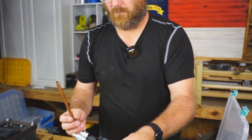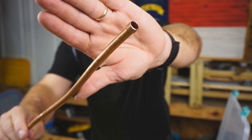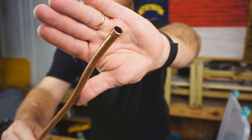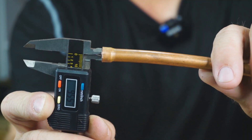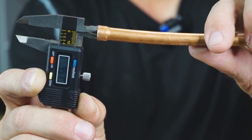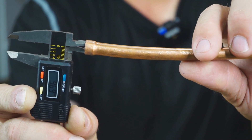That was much faster right there. A little bit of grease popping out there. Here is the end of the copper. One of the things that can happen on the 3/8 is that expanders can split the piping. It hasn't split the piping — it looks like it's expanded right within the limit for not splitting. There are some stressed-looking areas on there, but it's not split in any location. The interior diameter of the pipe is 9.68 millimeters. If I rotate it 90 degrees, it's 9.57, and another 90 degrees it's 9.69. So pretty close to a perfect circle. You can see the pattern that the expander creates on the very end.